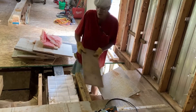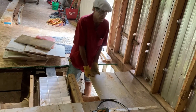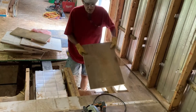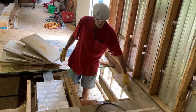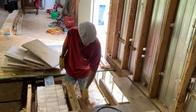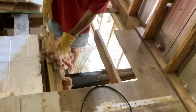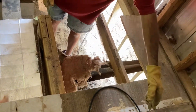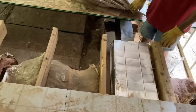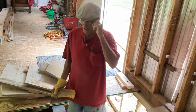Obviously this repair section is a little harder because it's plywood as opposed to particle board, but it still comes out easy. I'll cut along there with the saw, and once we get beyond to the next beam — you can see the beam there that goes all the way across — then we'll cut the joists off. I hope that's a good enough demonstration of what we're doing here.